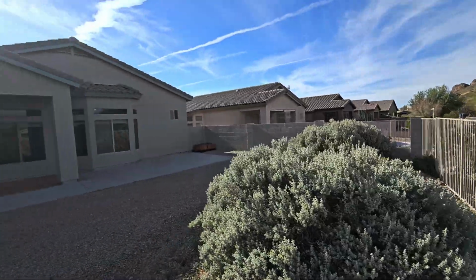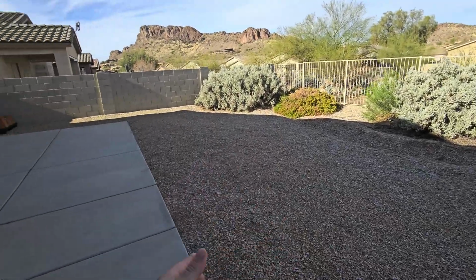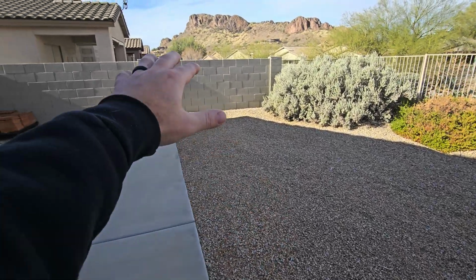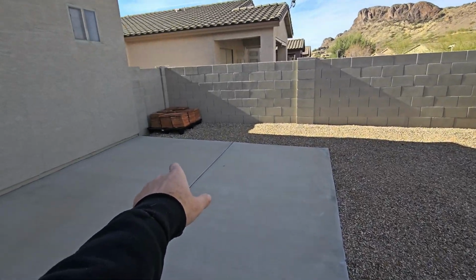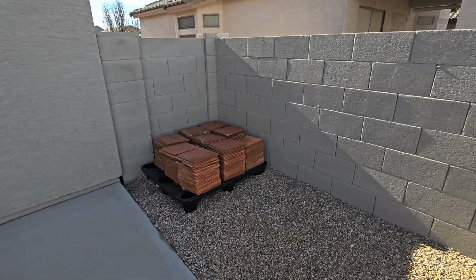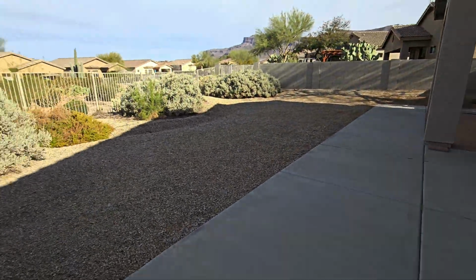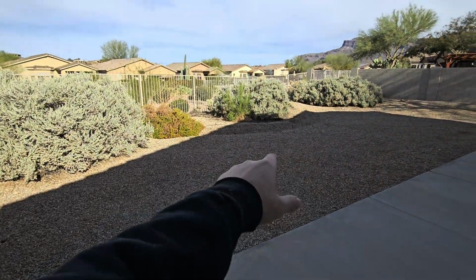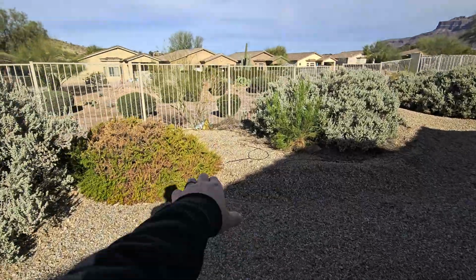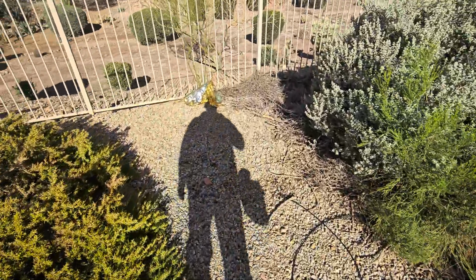It's beautiful. So let's say that you get about an inch of rain out here. Where do you think the water is going to go? So we're looking for the low spots. An inch of rain falling here. We're not going to get any to go out to the street this way because we've got this in the way and the landscape is built up. So this is a higher spot. That's a lower spot. So we're definitely going to get water going this way. So we want to make sure that we have a little channel for it to get out of here. You can see this little divot or swale built in here.